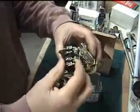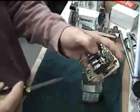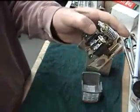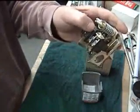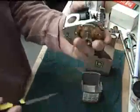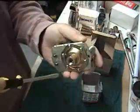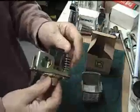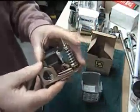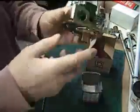This switch opens and closes the contacts — when they're open, power isn't going through; when they're closed, power's going through here, and that's what operates the switch. These also come in another mounting besides the quarter-inch pipe — they come in a flared fitting for about quarter-inch copper tubing or less. I really don't like them because they're wiggly and all over the place, so I prefer to go with these rigid ones if I can.